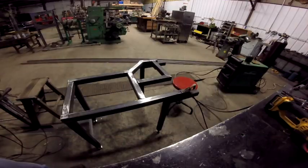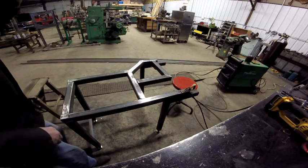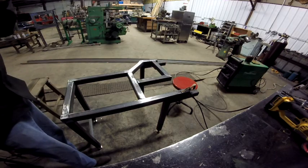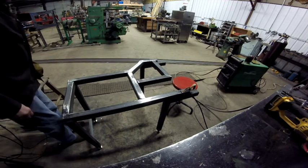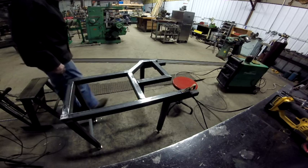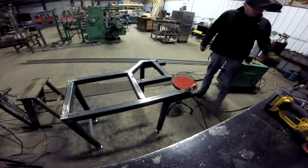there it is. I'm going to take it back and weld it out and start cutting the expanded metal for it. I'm going to give you some shots of this. I'm probably going to edit it, just shot some of the welding. Table's down on the floor. Going to do the top. Going to stagger around so that I don't build up too much heat in it. I'll hopefully keep it from warping.